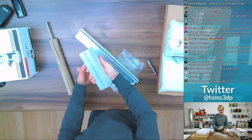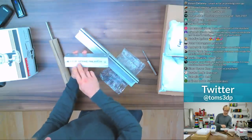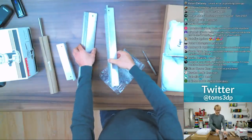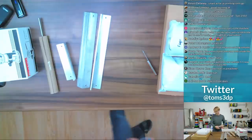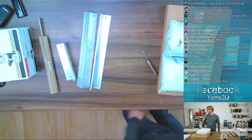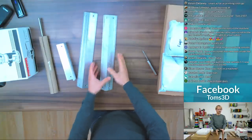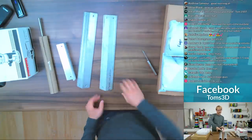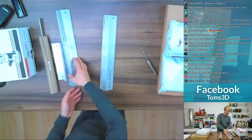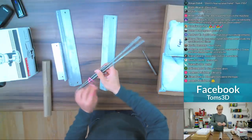All right, that's... Ooh, even got the labeling on there. Malaysia. Aluminum, Malaysia. So that's the Z-axis, and we have X and Y. Now, extruded parts, whether it's aluminum or plastic, usually have fairly good tolerances there. They're usually fairly accurate as far as just the overall dimensions go and straightness goes. If anything, they might be ever so slightly curved, but the dimensions are going to be good, and the surface usually is really good. So yeah, if they make it work, that's going to be a very smart use of